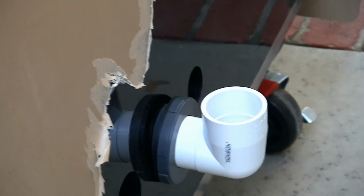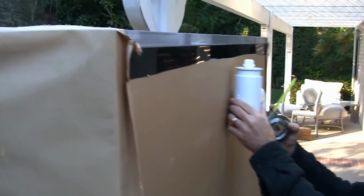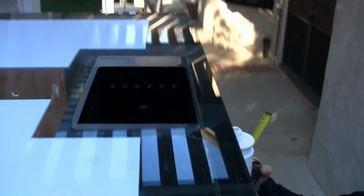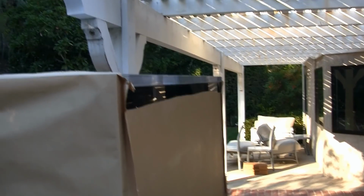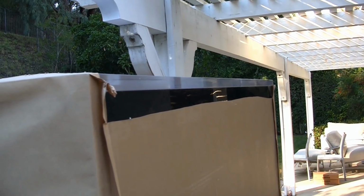Okay, so first thing we did was make sure that the new bulkheads fit, and they do, so this part of the project is a go. What Scott needs to do now is work on getting the plumbing inside the internal overflow, which will consist of a 2-inch Durso standpipe, a 1.5-inch return line from the filter system, and a 1-inch emergency overflow.